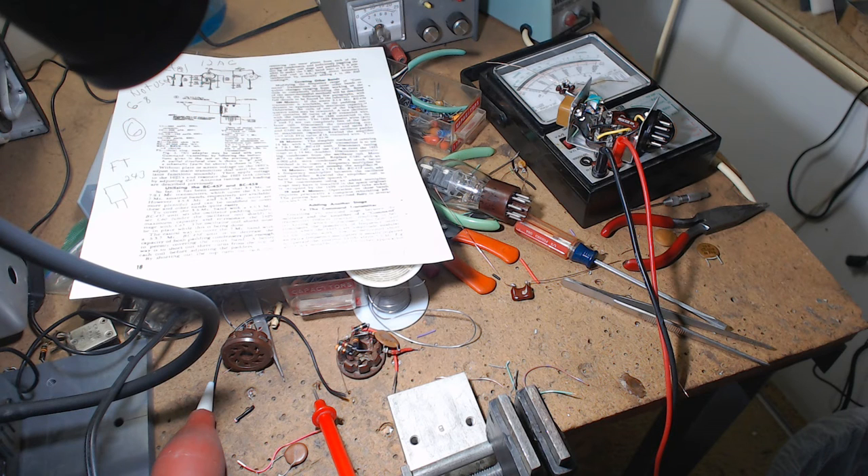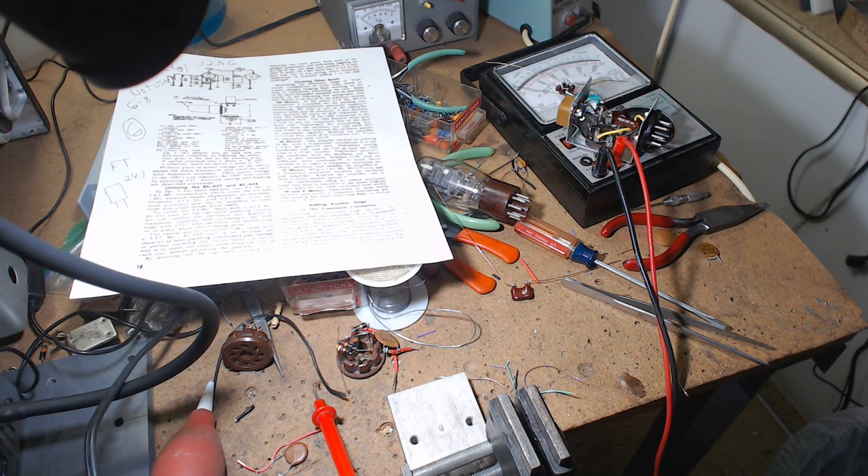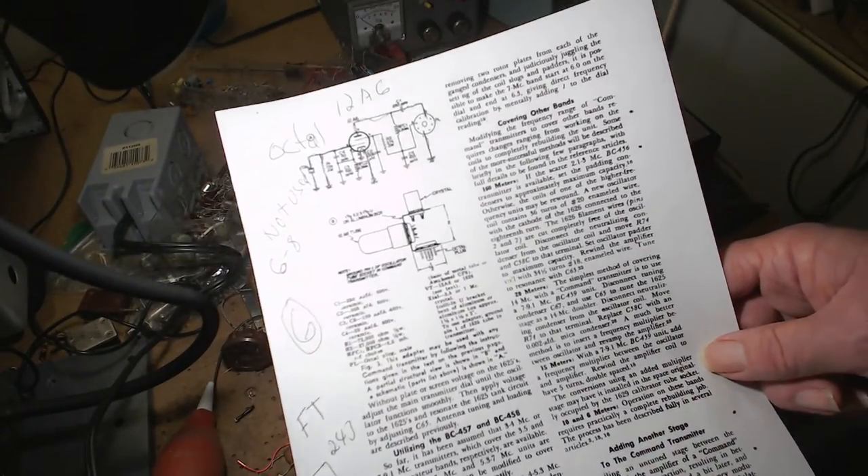Chirping is also caused by the oscillator not being regulated. When your power amp turns on and off, the voltage drops on the oscillator and causes a shift in frequency. That shift, when it gets beat with the beat frequency oscillator on the other side, causes a chirp. A lot of people say keep the oscillator running all the time and regulate it. During World War II they didn't do that because you don't want the oscillator on during radio silence — antenna arrays could actually pick up a leaking oscillator from approaching aircraft. That's also why the BC-348 has an extra amplifier on the antenna — to keep the oscillator from leaking out and telling the enemy the squadron is coming.